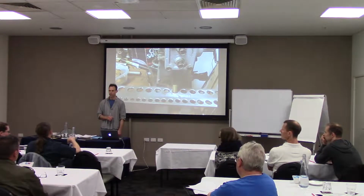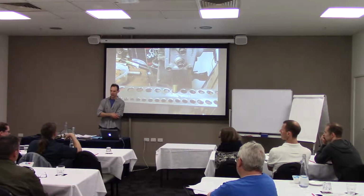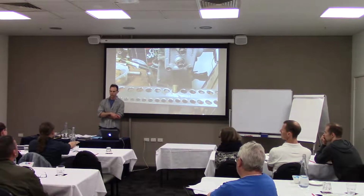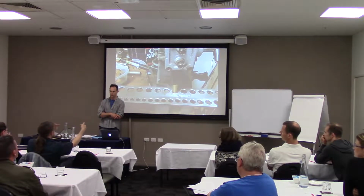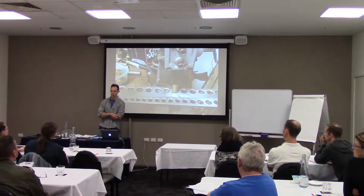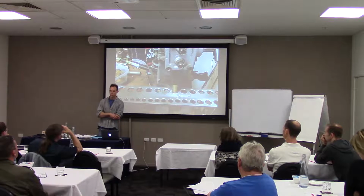And that disc is then reused by some other makers of like trumpets or whatever, so you can use this disc again. And I have a press like that, and what I did is I put it on the corner of the bench, and then put some pieces of steel, I screwed that basically onto those 2 feet, so I can extend it, so I have a longer press range. Right. That works quite well.